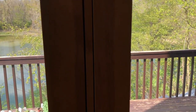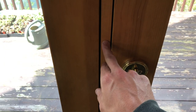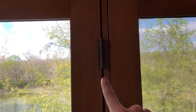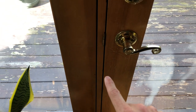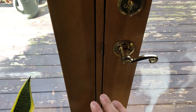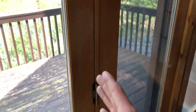A couple of different things to check: you want to make sure that the gap on the door is the same at the top and at the bottom. My door is pretty well aligned in its space, but the door jamb is out of line — the hinge side has a narrower gap that opens up to a big gap on the other side. Figure out first whether you have a gap at the bottom or the top, or an even gap. If you have an even gap, the hinge side most likely does not need to be adjusted.